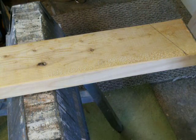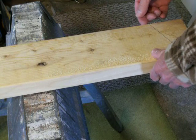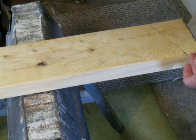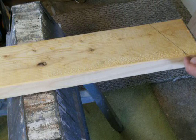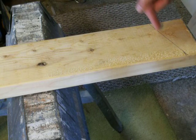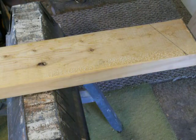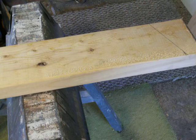Now, what we want to do is we have to lay this out so it's going to be on an angle. Our angles are going to be the total length on the bottom or the top — we can flip that up and get that figured out. We also have to remember that we have to shorten the rafter up on the top to make sure that we get around everything at our ridge board. So we're going to go back up to the top and shorten it.